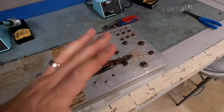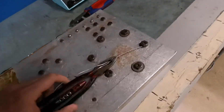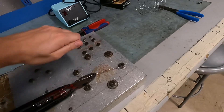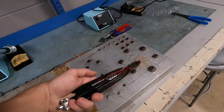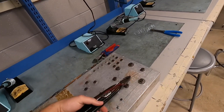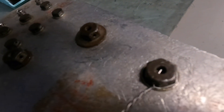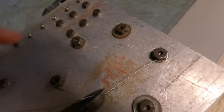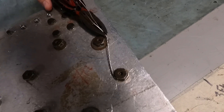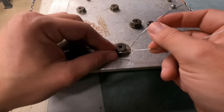I'm going to give it one or two more turns, and that leads me to my third tip. I'm twisting in this direction and I want to tighten this up a little bit. If you grab the pliers and make a cone-shaped motion as well as twist the pliers, it will wrap them a little bit tighter all the way down at the bottom — you can almost see an extra wrap put in right there at the bottom. So that, coupled with the 90-degree pull, is really going to make that wire nice and snug.